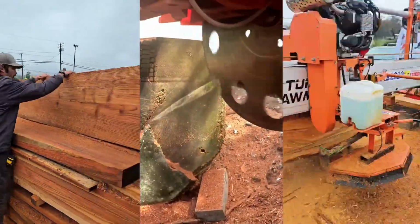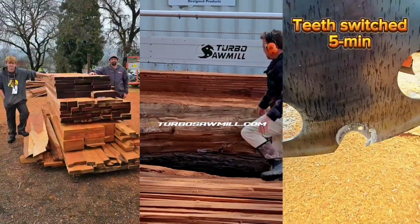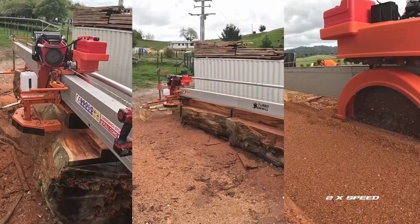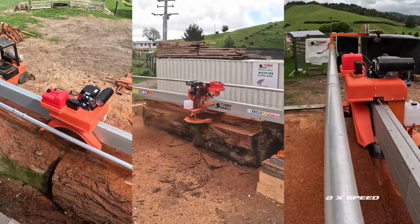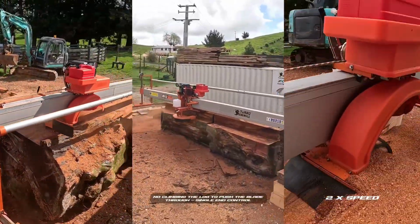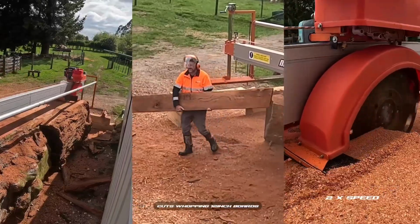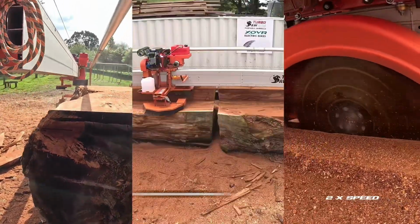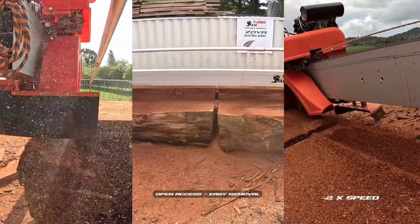That was production milling. It meant the saw was always in the cut, even while you were offloading. In contrast, twin blade systems had to complete a full pass, pull the board, return empty, and start again. But there was still one major limitation: the second rail. While it supported the structure, it made access harder. Loading logs and removing timber became awkward, and even with automation, the twin rails could slip unevenly, especially during deep vertical cuts, forcing constant realignment.